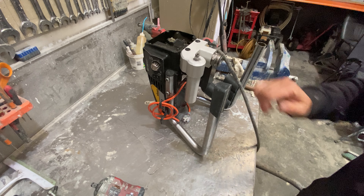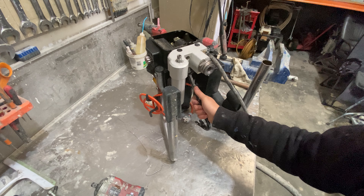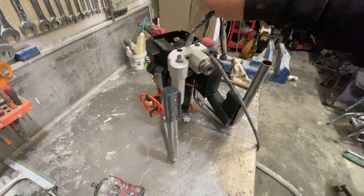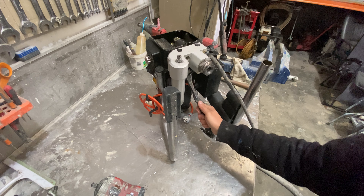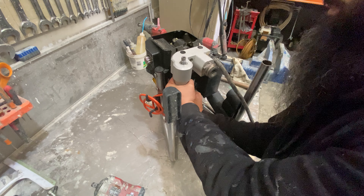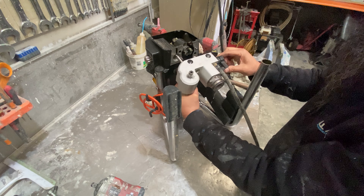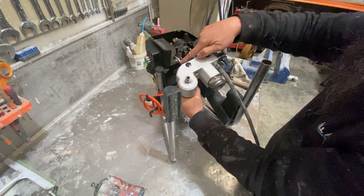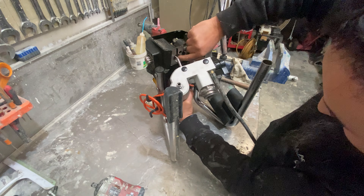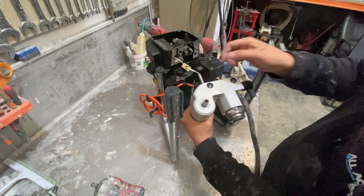We're going to slide this pump out. I'm going to go in underneath the back of the pump — there's a slit just like we do here, so there's a little bit of space for it to go up. I'll gently push it out, get the pump out as far as I can. I'm not going to yank it because the transducer is connected to its jack, so I'm going to slowly work that out, careful not to damage the transducer or the jack.